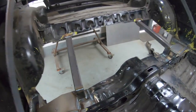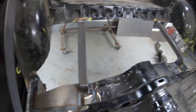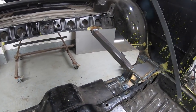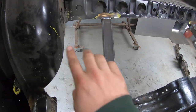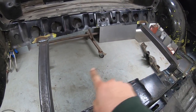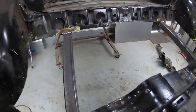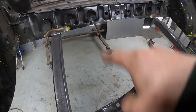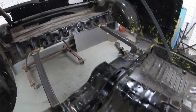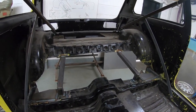I'm just going to test fit the axle back in, try and clamp it somehow - don't want to drill it yet - just to have a look. Basically there'll be three flat sheets: one in between the two chassis rails, and two either side. A friend of mine is lending me his swager, so I'm going to put a load of ribs in it to try and make it look a bit more factory with the floor pan. Oh man, I'm chuffed with that!